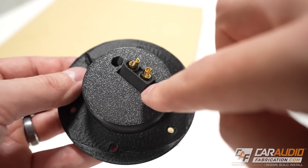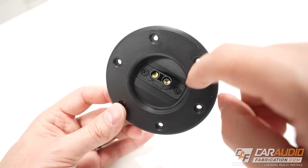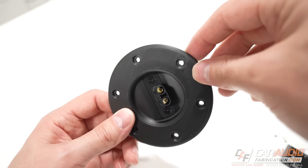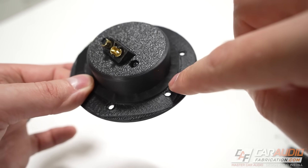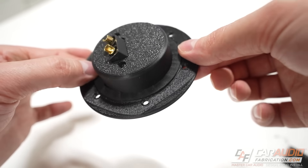I'm only applying the gasket to the inside edge here rather than a full gasket design, because I'm going to pick mounting hardware that doesn't break through to the inside of the enclosure — it's not going to be more than three-quarters of an inch — so I don't have to worry about air escaping out of those holes. Here is revision number two. We're tighter into those corners, I've corrected the nut size so it holds itself securely while I screw in each fastener, there's a larger round-over around the top of each hole, and we have the channel for the foam seal, which I've now added into place.